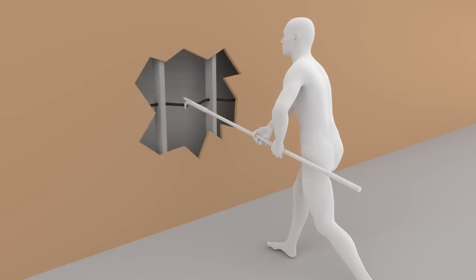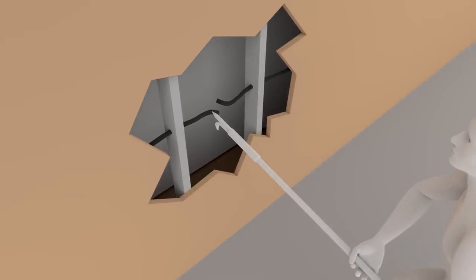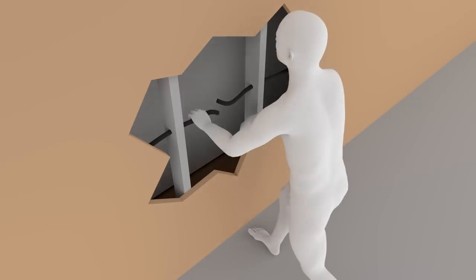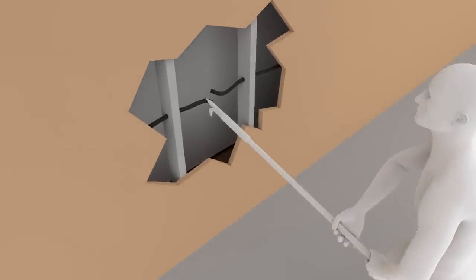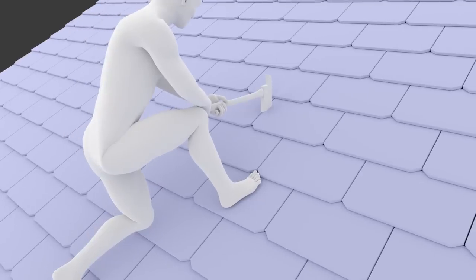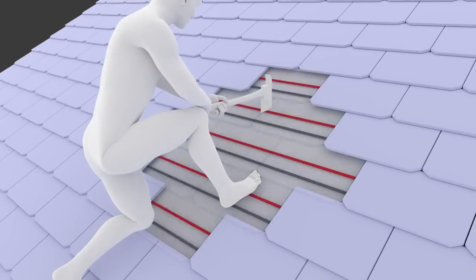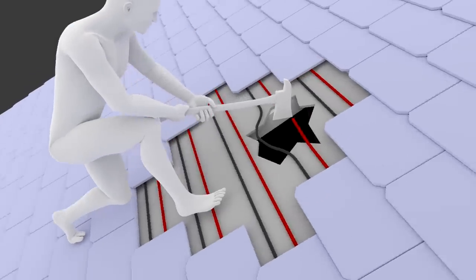However, in AC circuits, like we interact with during overhaul operations in structure fires, things are much different. The firefighter only needs to come in contact with one side of the circuit because it is earth-grounded. Additionally, if a conductive tool is used to cut the wire, the rescuer could receive a shock because the circuit is earth-grounded and the firefighter could become the path of least resistance. Because the solar roof is a non-earth-grounded DC circuit, the possibility of a firefighter receiving a shock is highly unlikely. Therefore, conducting normal roof operations, including cutting or crushing any part of the solar roof system, is deemed safe practice.